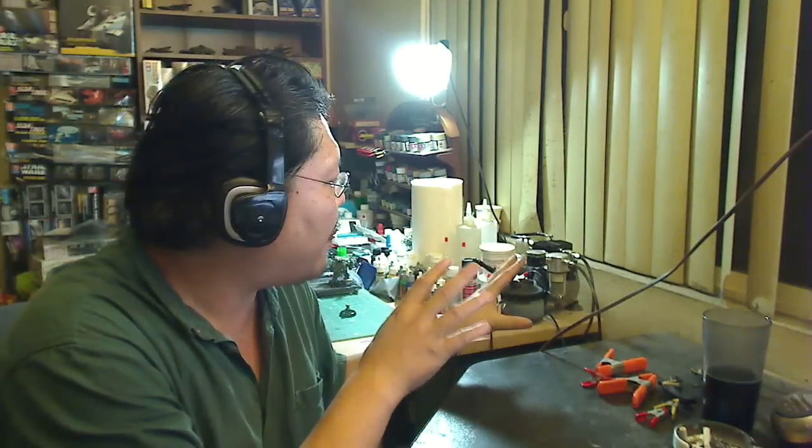So now that we've got that out of the way, you've seen the tank. Okay, you've seen the compressor. I was putting them together. There are some compressors out there that come with a tank. So what it does is that the compressor sits on the tank, and then it fills up the tank, and then you would spray the air out of the tank itself. When the tank starts getting empty, the compressor kicks in and fills the tank. Okay, great thing about this is less noise. The only time it'll make noise is when it's filling up the tank. Okay, and when your tank is filled up, you just spray out, adjust your PSIs on the regulator to whatever you need it to be.